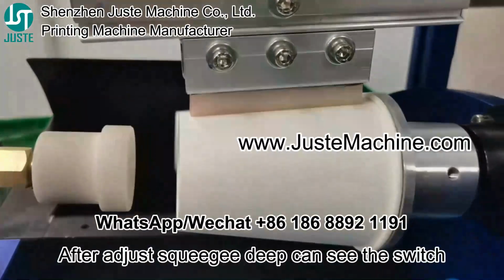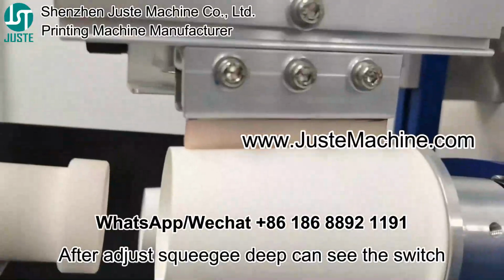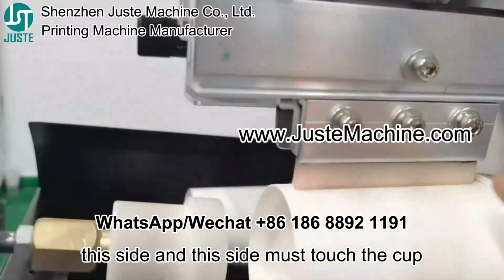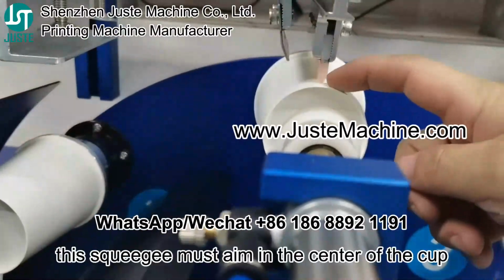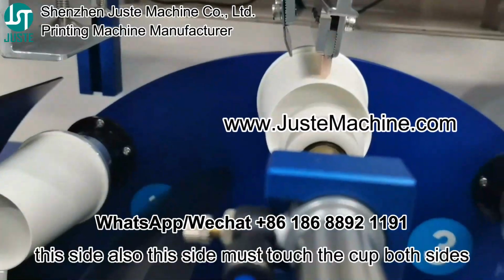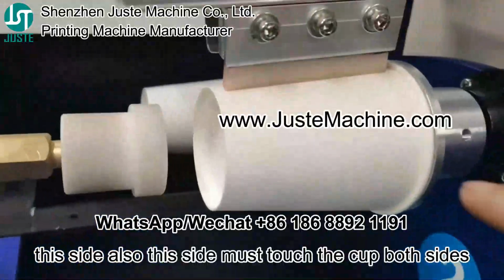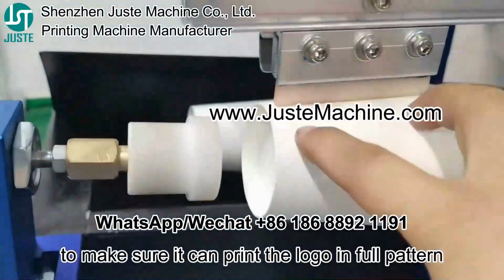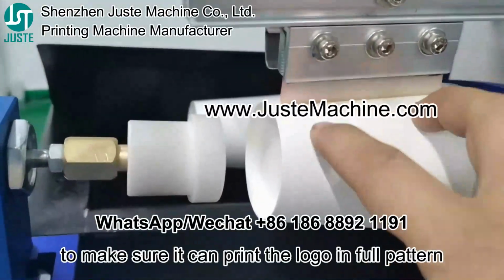After you adjust the squeegee depth, you can see the squeegee, this side and this side must touch the cup. The squeegee must aim at the center of the cup, this side. Also, this side must touch the cup on both sides to make sure it can print the logo's full pattern.